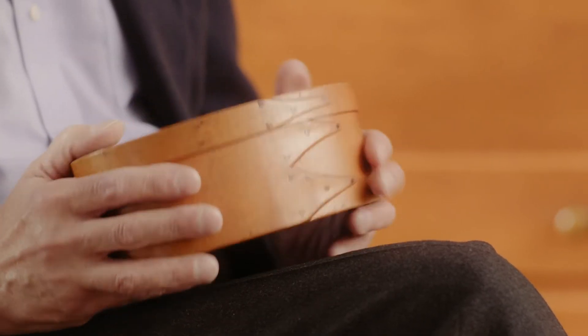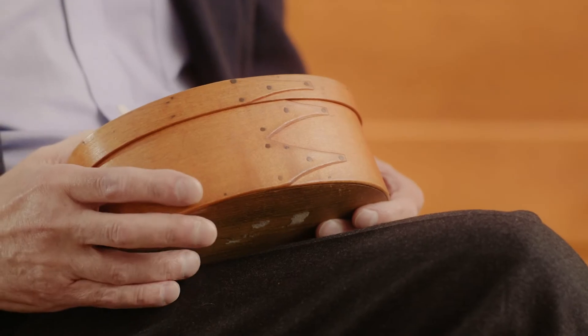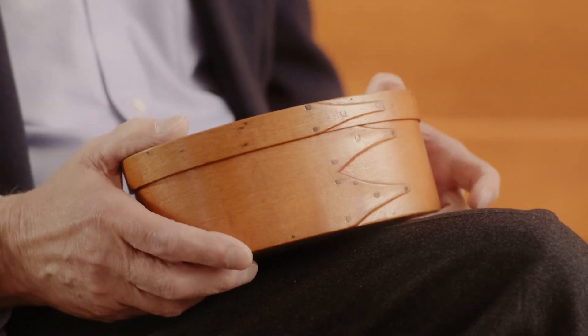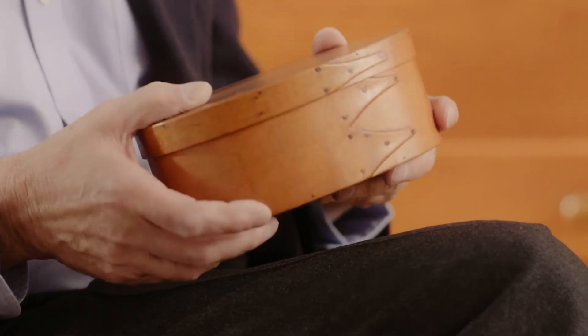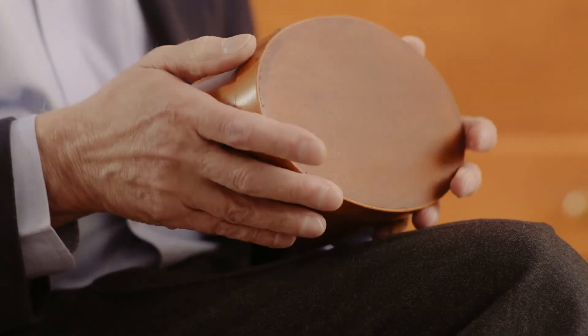The bodies of the boxes — the rims — were thin flat pieces of planed maple. These pieces were cut to size on templates that allowed for the overlapping swallowtails and the placements of the copper rivets that would secure them together. Once cut to size, the bodies were immersed in hot water or subjected to steam in order to make them pliable. Then they were rapidly wrapped around a form and secured by the addition of the copper rivets. The top and bottom boards of the boxes were called the heading. The heading was cut after the forms were dry and secured by copper points or brads along the rim. Made this way, the boxes prevented deterioration of contents or accessibility to insects.